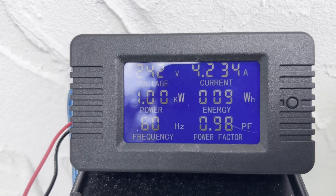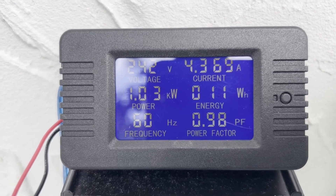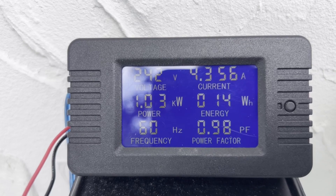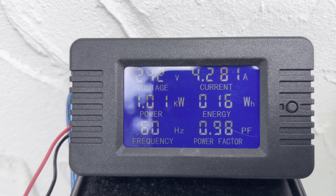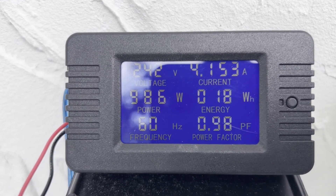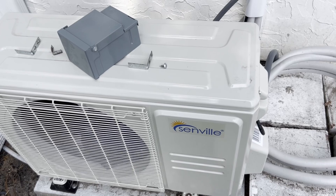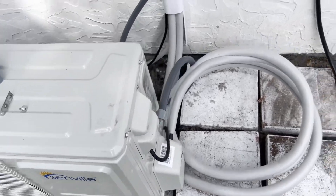We'll come back once it settles down, but just so you can see the peak kilowatt usage when it first comes on — it's about 1,000 to 1,800 watts. If I were sizing a generator for this, I believe any of the 2,000-watt generators would work sufficiently. I have a Honda EU2000 so it would definitely start this up without issues.